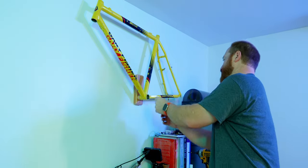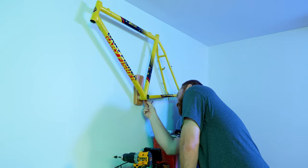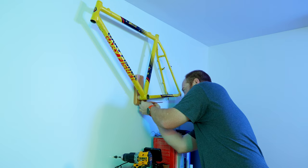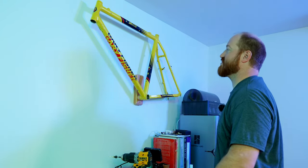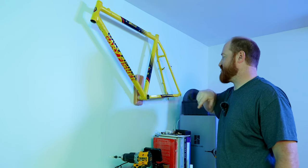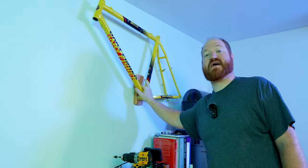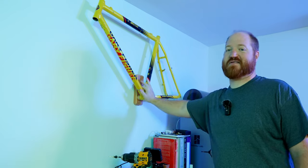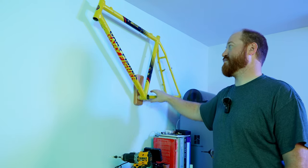I had to loosen up the anti-rotation bracket, but this goes in easier and it's nice and tight now. The only problem is that screw is a little loose and impossible to get to, so I might change that out with a hex nut so I can get a wrench back there and get it solved — but I'll worry about that later. This project is complete. I don't like doing that kind of thing but it was still wobbling. This is in the proper position now and everything is tight. I will go back and replace that stripped out screw with something better for this application.